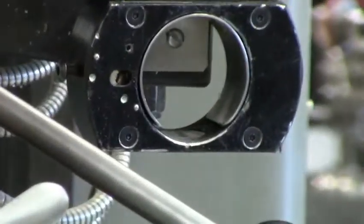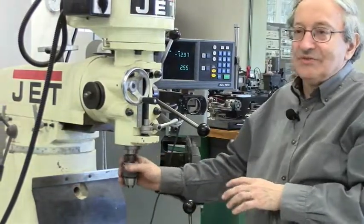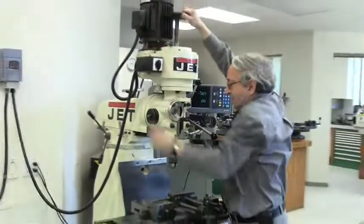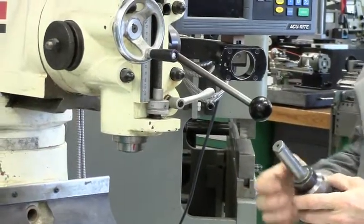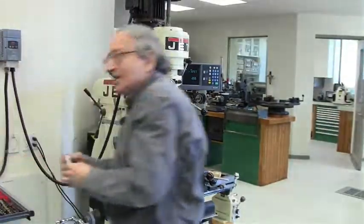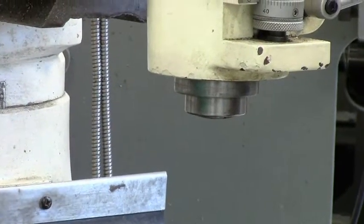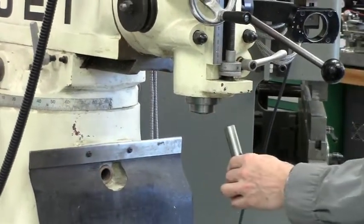This is all what you need here. One other item: it is desirable to standardize on one collet size for all your tooling, so you don't forever have to change collets when you change tooling. This machine is standardized on a three-quarter inch collet, so everything that goes here — the chuck, boring bars, and all accessories — they all have the same shank. Even if you do some drilling or milling, you try to pick mills which also have the same shank, so you can switch instantly from milling to drilling. You cannot use milling cutters in a chuck — it's not rigid enough — but this way you can switch from milling to drilling to boring. It all sits in the same collet size.